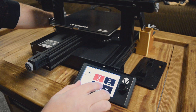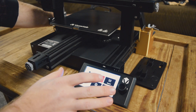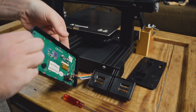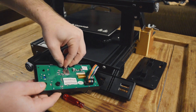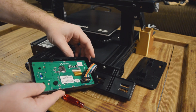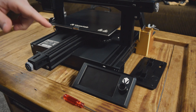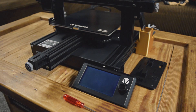You might not see the icons yet and I'll show you why. Once the printer goes back to the menu, go ahead and turn the printer off and wait for it to fully kick off. Take the display, flip it back, take the SD card and slide it in here — take your time, there's that click — keep everything plugged in and set it down. Now we're going to turn the printer on again. This time it's going to use that folder with the assets to install them on the actual display.